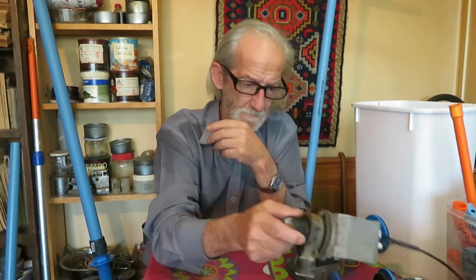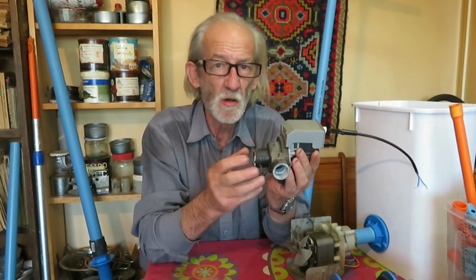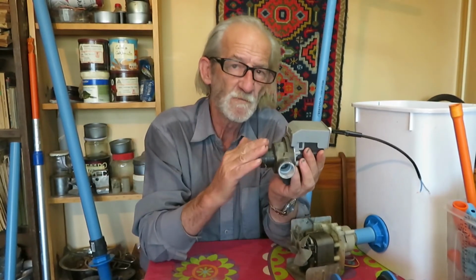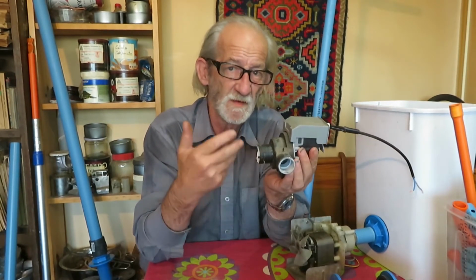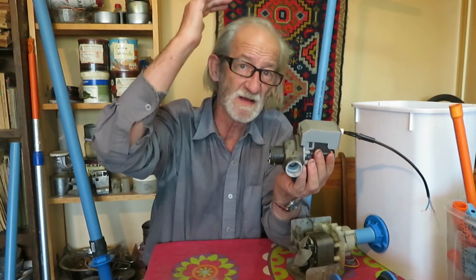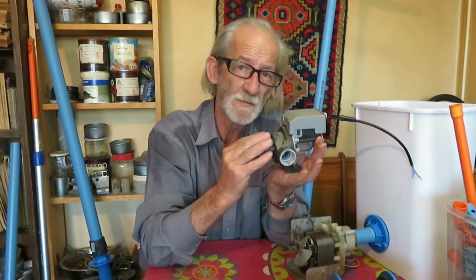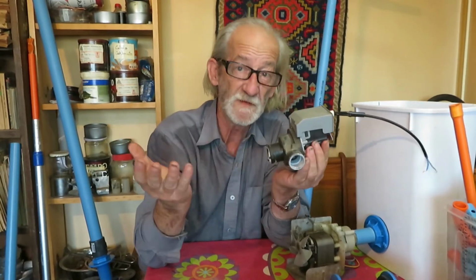Now, these water pumps are very low in energy, 30 or 40 watts at most. So they aren't expensive when running them. And by rules, they have to lift the water 1 meter high, at least. Some of these pumps are capable of lifting the water above 2.5 meters, or 8 feet if you want.